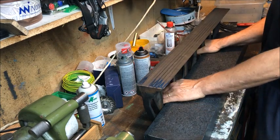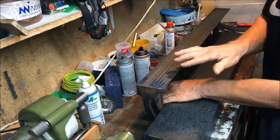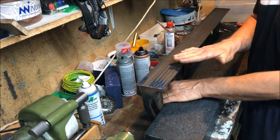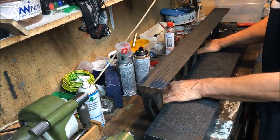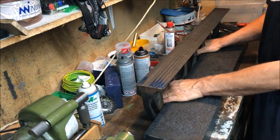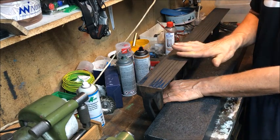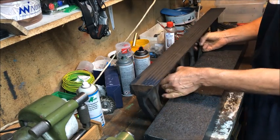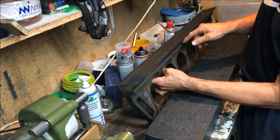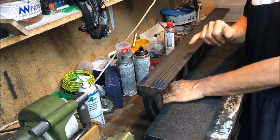It came out very nice. I was surprised at the accuracy and the ease of operation. As you can see, I blued it up — it's high at the end. That probably could have been better with a little bit stiffer setup, but on the other hand, it's well within reason. It is four to five hundredths down here, but most of it is three. The same at the dovetails or the angle section, but less — one to two hundredths of a millimeter high.